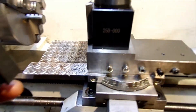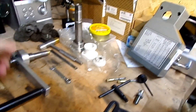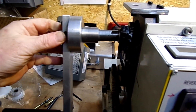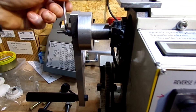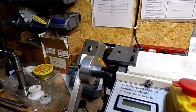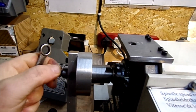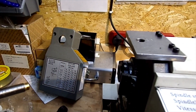You can also see I've got a different tool post on there, because the one that comes with it is really useless. The other thing is this handle — it's got a taper on it, slides inside and takes a mandrel. Tighten that up and you've got manual rotation for doing threading and stuff like that. If you have a look at Steve Jordan on his YouTube channel, you can see how to make one of those — it's quite straightforward, it's just a taper.